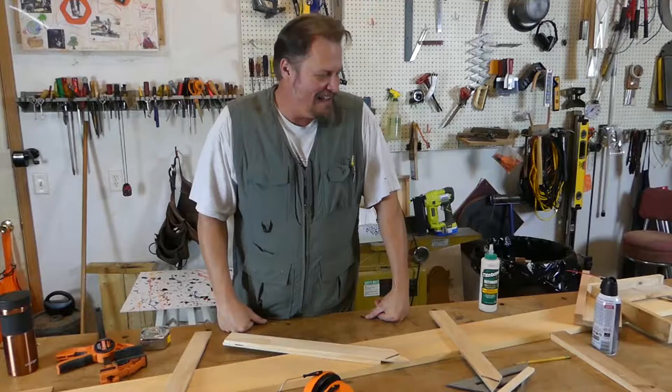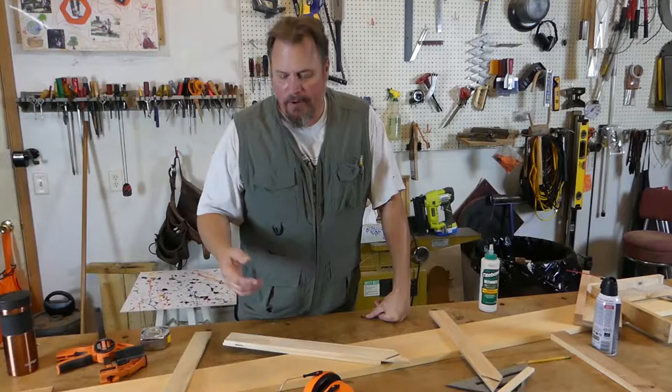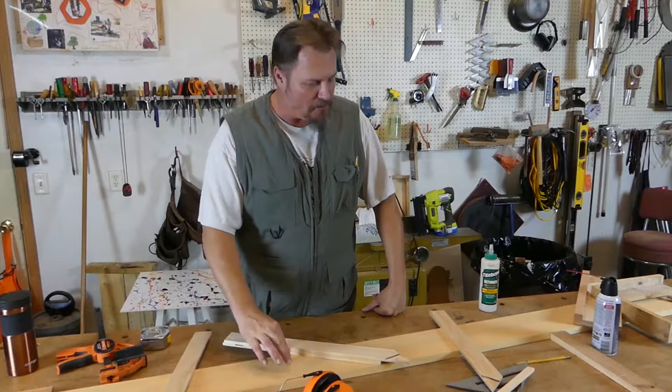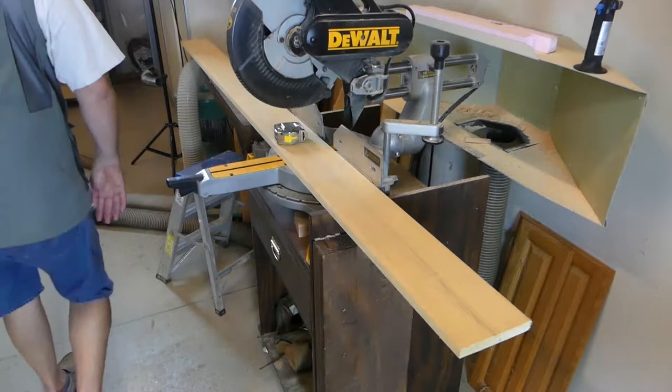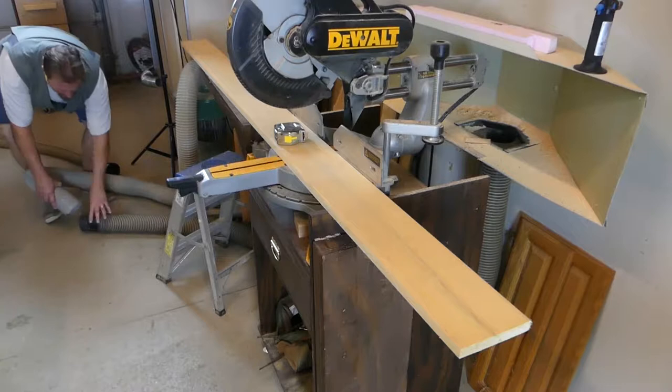All right, let's make the frame. I'm going to cut these into 2-inch wide pieces, put a miter in, put some biscuits in, and put together a frame. I'm going to run it through a dado, so I'm going to cut that groove out there so the picture fits in there solid. Pretty basic frame making for starters. Someday, I need to rig up a better air system, I know. But this is what I got for now.